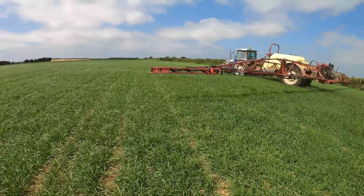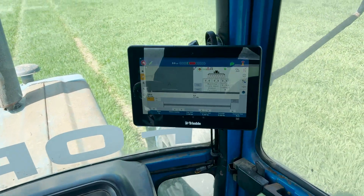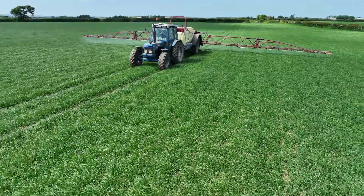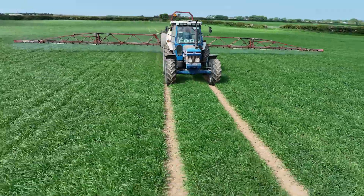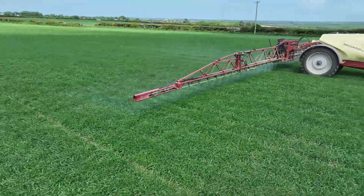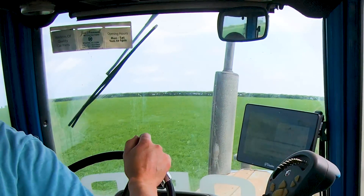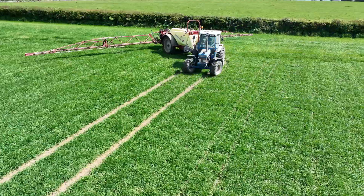What we fitted onto this Ford tractor is our GFX 1060 with the NAV 500, and we've actually retrofitted ISOBUS as well. So our display is controlling full section rate control. This tractor, although it's a 1998, is able to have the same functionality as a modern tractor — with a guidance system and being able to control all ISOBUS implements through the one display, keeping your cab clutter free. We can actually retrofit ISOBUS to any make or model tractor, giving it modern functionality.